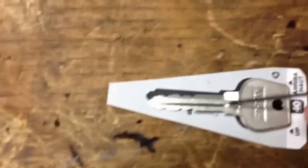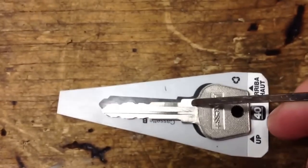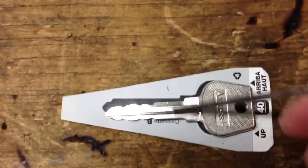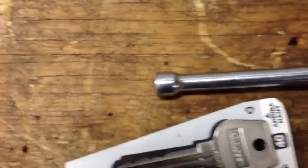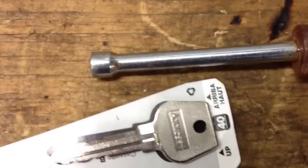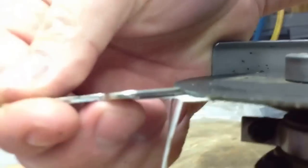So basically what I did: you go to Walmart or somewhere, get your key made. I basically cut it right there. The keys are made of brass, or at least this one is. This is a Mazda key — these grooves really didn't matter on a Mazda, and it pretty much stopped right there. I took the screwdriver, measured about two inches out, cut it off, and then grooved inside of it with the angle grinder — the thickness of that angle grinder is very, very close.